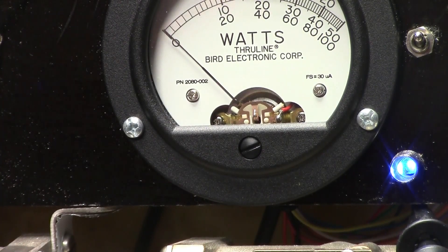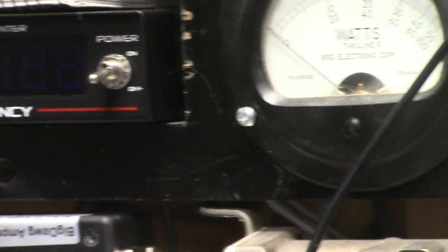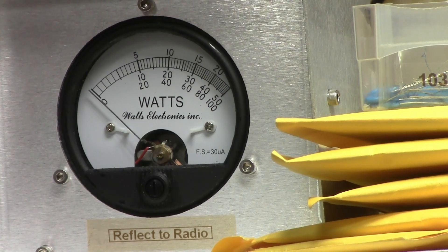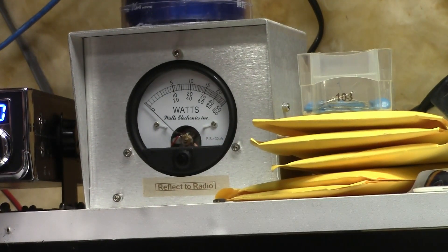Make sure the switches aren't switched there, might have had the right setting on the radio. It's right there around 40 watts. Show you pass-through tune — we are using a 5 watt slug for pass through, and our dead key is just under a watt.